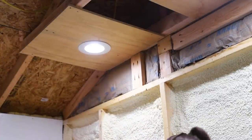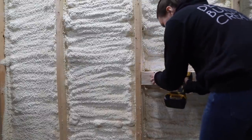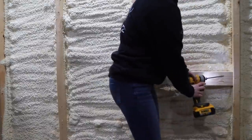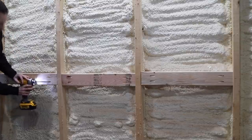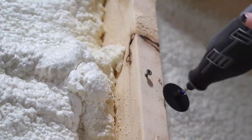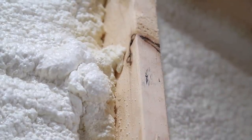The ceiling insulation is next, but we can talk about that in a different video. For this concrete accent wall, I had to add some blocking between the studs because when we built this workshop the studs were not on 16 inches on center, so I needed extra support to hang cement board. I also had to make sure the studs were completely flush, which meant removing anything still stuck in them — like leftover stripped screws from the pegboard. Luckily I had a Dremel with a metal cutting wheel from Home Depot's prospective program, and that worked perfectly.